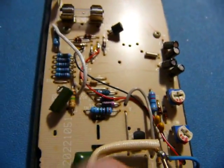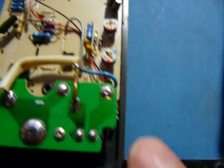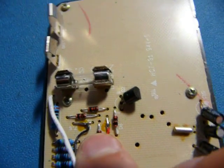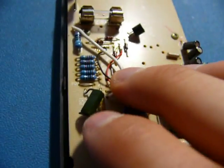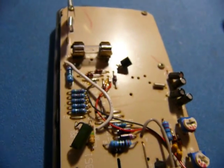Now, the things I don't really like about it — there isn't much input protection, if I'm honest. And look at this: these wires here, really, really thin ones going to the buzzer down there — see it? Right there? They're just soldered directly to little jumpers. Forget pads or anything like that, just solder it right to the jumper. And there's this little wire here — I'm not sure what it's doing. It's just kind of linking two areas of the board. I have no idea why they would do that.